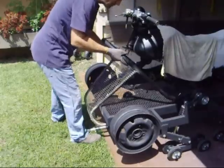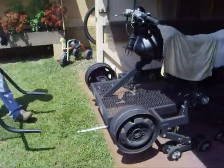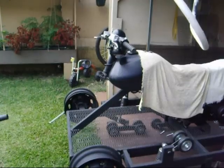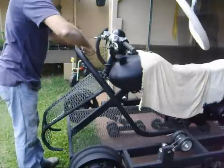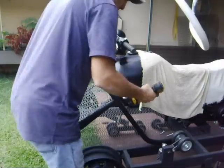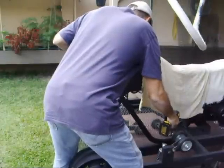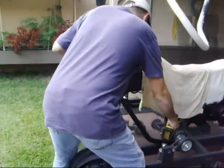Wherever the metal mesh has been welded to the pipe, I've been using a black polyurethane and I've secured that all the way around the edge. It helps with vibration, it looks good, and keeps water from getting up underneath the edges and rusting. Then I just use four bolts and bolt it back into position.